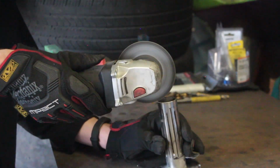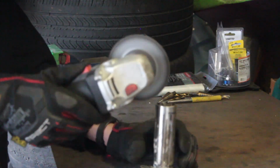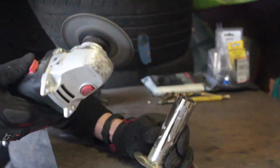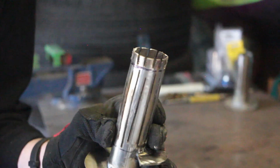This way we know that the bolts are going to thread back in when we try and put them on the car. Before installing our fiberglass mat, we want to cut several slots in the top of each baffle to create a bunch of tabs. 1 tab on each baffle will be folded outwards to hold the mat in place, and the others can be folded inwards to decrease the diameter of the straight-through exhaust.